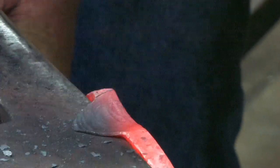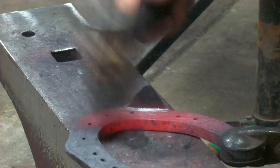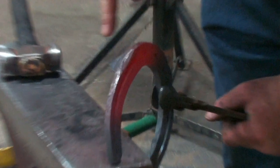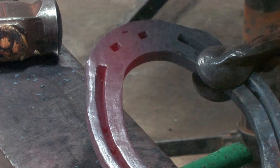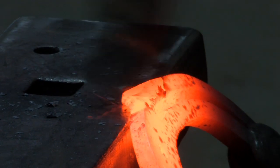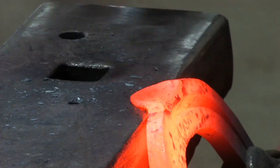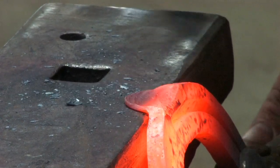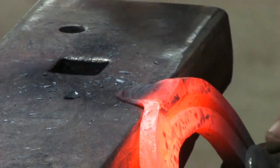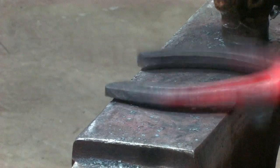As I've got my marks in the clip, now I've got to take them out. I've got a large clip — I'll level behind it. I'll set my clip onto the angle of the hoof wall. So even though I've got a large clip, I have only taken a small amount of source material, so it looks something like the picture of the competition. I'm getting the material back there with the round of my hammer. Now I can start drawing the clip from the base — stay at the base for as long as possible, get the clip coming up tall, then work to the top. Then flatten all the marks out and flatten behind the clip, then just forge the clip in.